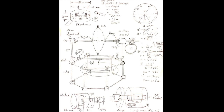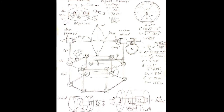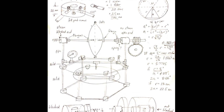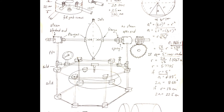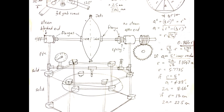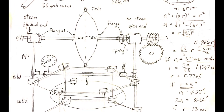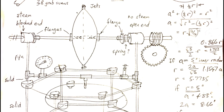We took a trip to Australia and while I was sitting there with nothing else to do I decided to sketch out how I might build the steam engine — and that's really what this project is all about. The boiler is spun from copper, and I felt that connecting a lot of pipes, brackets, and legs directly to it probably wouldn't be very good for it. So instead I decided to make a hexagonal framework with the tank hanging in the center, and a horizontal pipe going across as a manifold with all the devices on it: a pressure gauge, a pressure relief valve, the tank connection, a tap to turn the steam flow on and off, and then vertical pipes going up to the rotor itself. The rotor has been spun from copper, though I haven't made all the bearings for it yet.